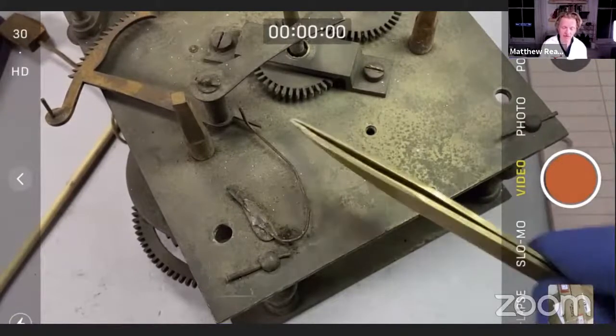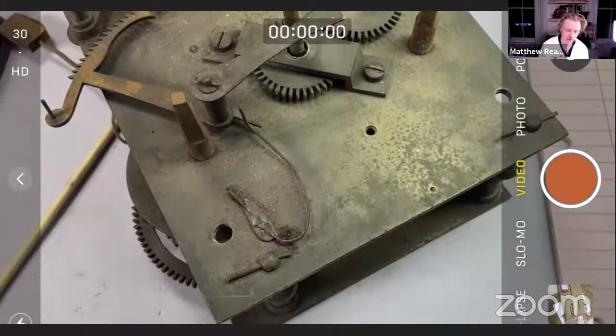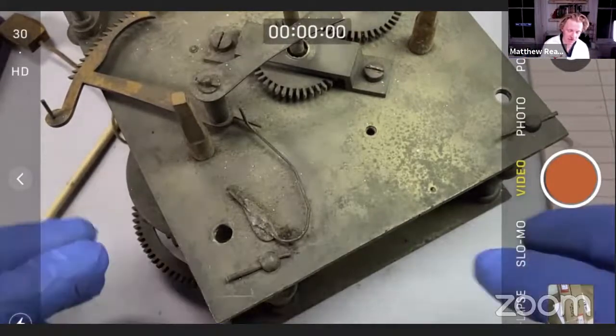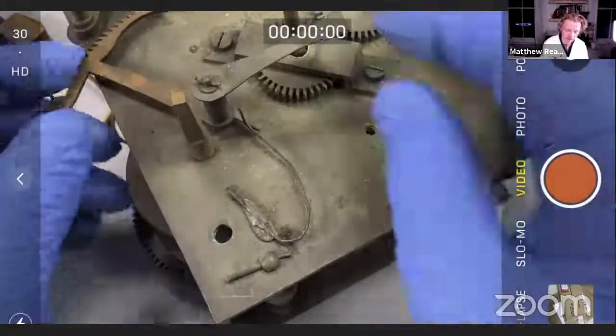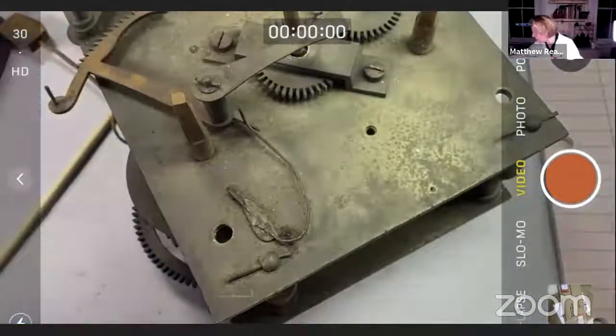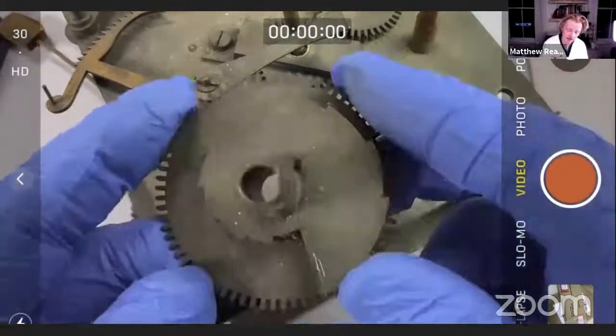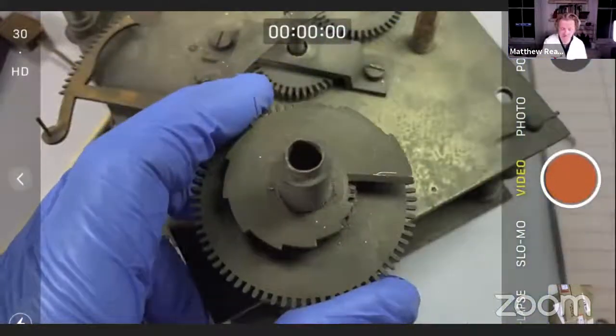And of course, what you've got here is a bit of steel. So wherever possible, you want that combination of brass on steel. You don't want steel on steel or brass on brass. You want dissimilar materials. So luckily, our rack arm looks good. The pin is there at the back. It's got its safety action there. And that's obviously happened relatively recently, that scratchy mark.